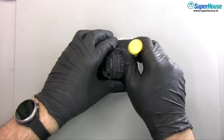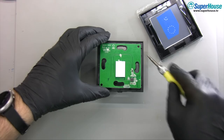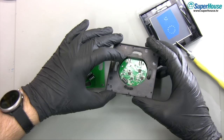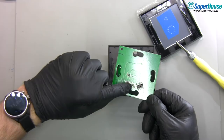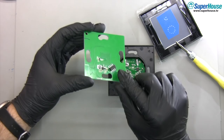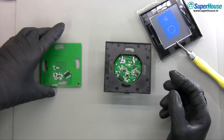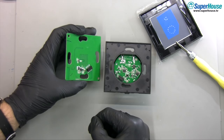What we're really interested in is looking inside this device and seeing what magic it's got hiding in there. Just like other Sonoff Touch models, we can pull it apart by prising these little tabs open. The front cover comes off to reveal the main logic board. Just like with the other Touch models, it's a two-part system. We have the high-voltage part at the back, and then the logic board. On the logic board we can see an inductor, a diode, and a couple of other things — that's probably the power supply for the 3.3-volt logic.